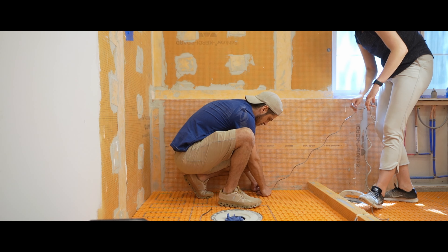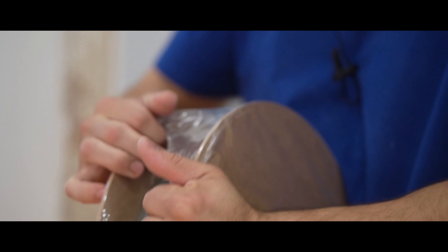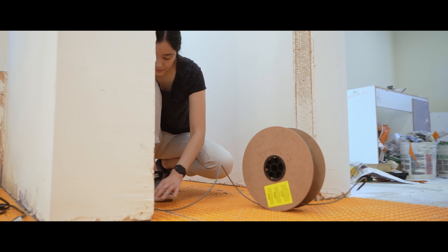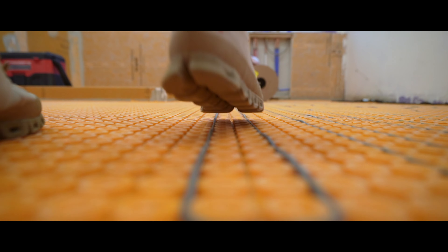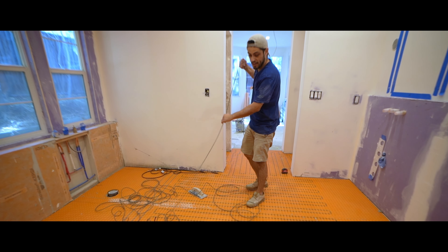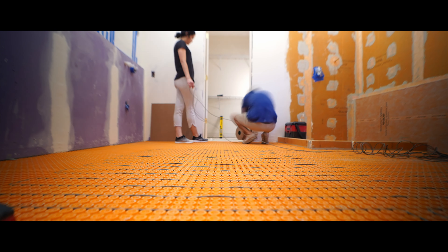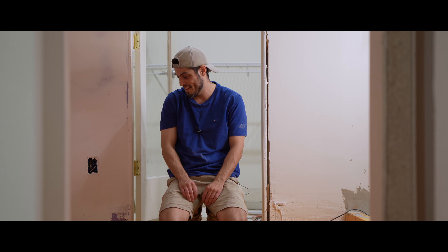I think we're going to have to play around with this a little bit. After a few attempts, I think we got it. Now for the second run — the entire rest of the floor. The reason it has to be done in two runs is just in case there's water damage to the first circuit in the shower; it won't affect the rest of the floors. This second run is going to take some adjusting too — we'll try a different stud spacing because we're a little short. The nice thing about this system is you can adjust the stud spacing to release or eat up more wire, and it's the only way to adjust because these wires can't be cut. Hell yeah, we got it — that's all Michelle's planning.